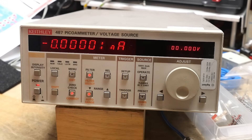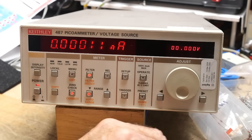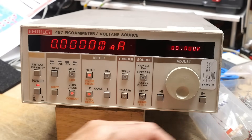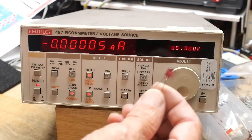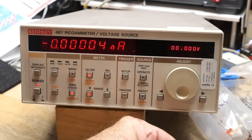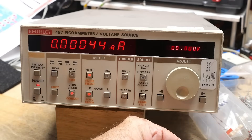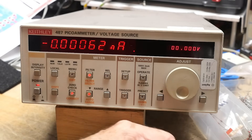I have a cable here and some wires so we can solder things on and see what happens. I thought we'd start with probably the most famous thing everybody measures — an LED. Everybody goes, 'oh, LEDs can be used as a photodiode.' They make really, really crappy photodiodes, but they do work. So let's go ahead and just tack one on.